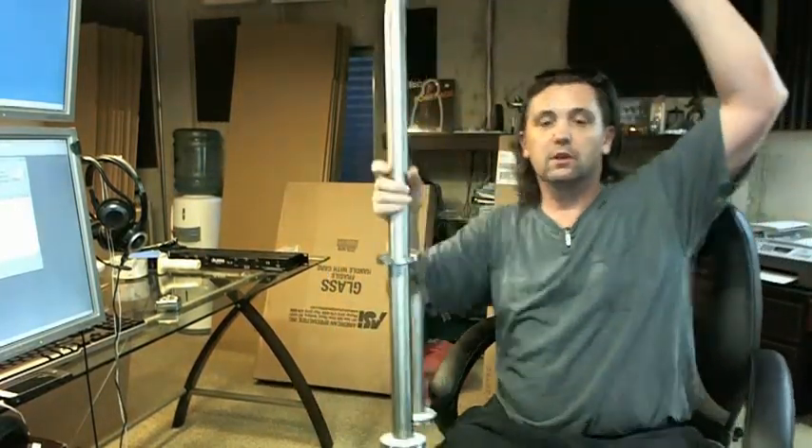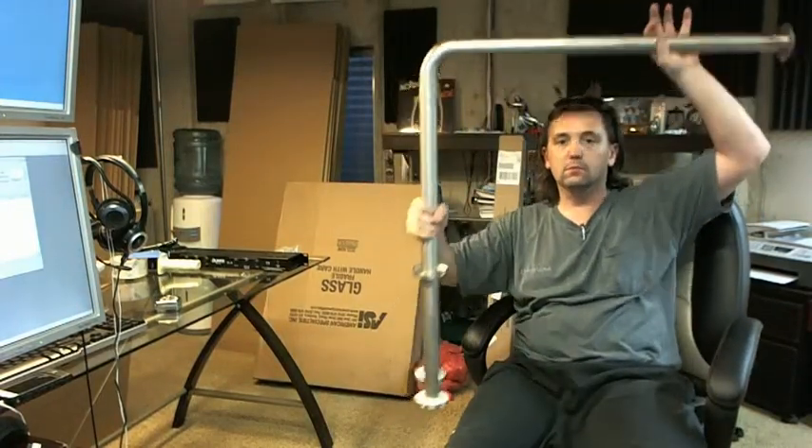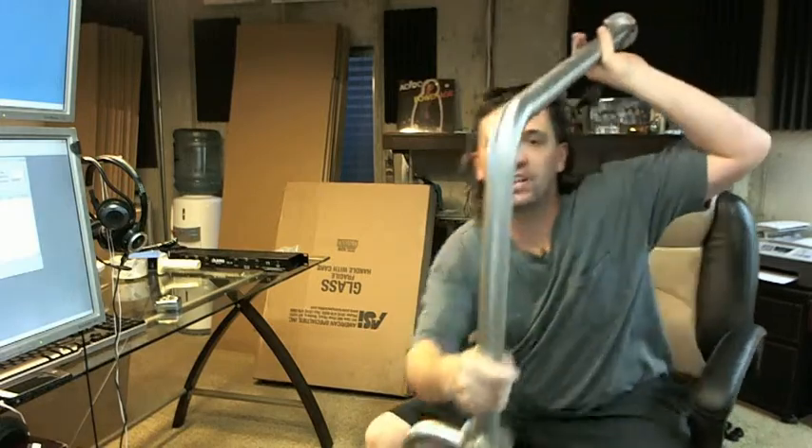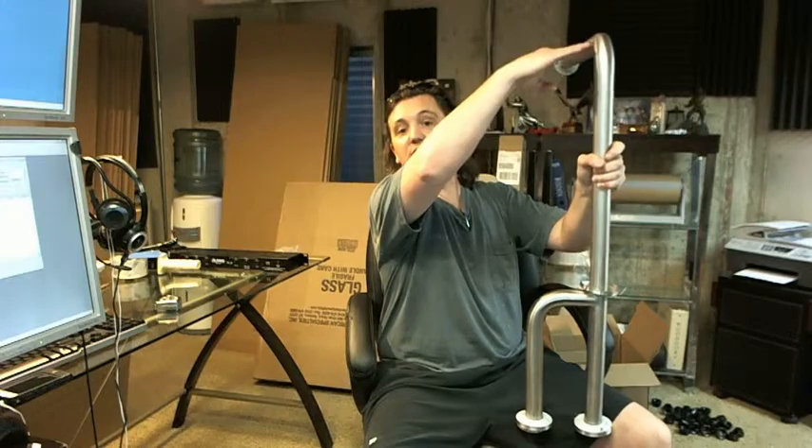Here it is — it's quite large to show in the camera all at once, but at least you'll get an idea of what it looks like. The 30 inch dimension is the dimension from the wall to the center line of this bar. Your 33 inch dimension is going to be from the floor to the center of the horizontal bar. That's the 3833 — it's an outrigger style.